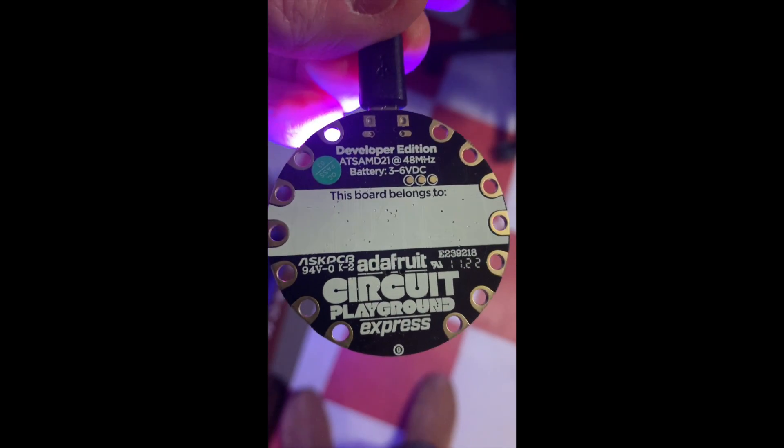You may remember the Adafruit Circuit Playground Express. I decided to program the LEDs to alternate — one is kind of a bluish color and one's kind of a purplish color. I found some RGB values and will publish the very basic code that runs on it to create a mini grow light. Each one of these pixels is estimated to put out about 1.5 lumens. To give you an idea, a basic house plant needs 10,000 to 20,000 lumens, and a fruiting or flowering plant needs way more than that. A lot has to do with the angle of dispersion of the light and how close it is to the light. So let's pop this in and see.